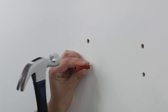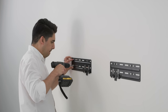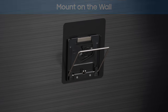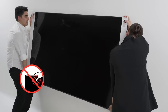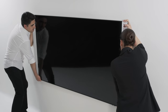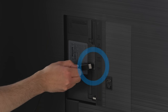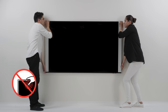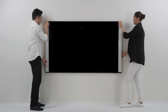Tap the anchors in with a hammer or a mallet. Place the brackets in position, insert the screws, and slowly screw them in. Pull out the hanger and lift up from each side. Make sure to grip the edges of the screen when you lift the TV, then hang it on the bracket holder. Now it's time to connect various devices to the TV. Spread out the holder support and connect the cables to the back of the TV. Gently nudge the TV back to place it closer to the wall. Remove the EP pad and protective film.